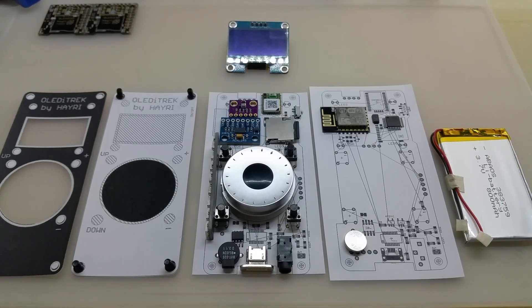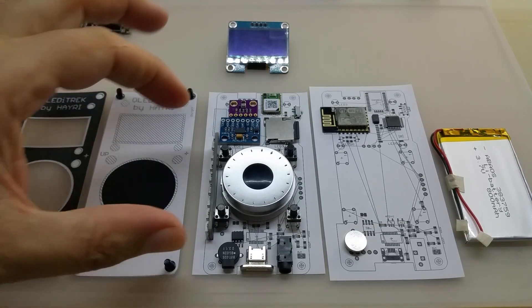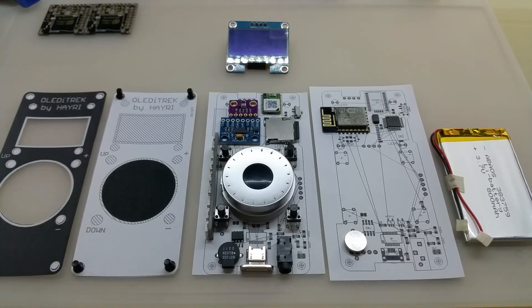You can have many different codes on the micro SD card and upload whichever one you want to use. If you don't do anything on startup, it will upload the last code that was on the ATmega chip — so it could be a GPS clock or whatever you like. It also has a NeoPixel stick, so you can use it as a flashlight, a police light, or anything you can imagine.